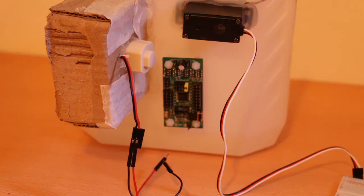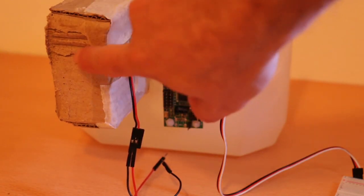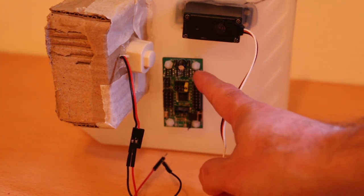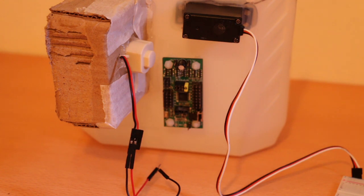This is the backside of it. When I build DIY stuff I prefer using whatever I've got lying around and not buying anything — I admit my drawers are a bit fuller than most people's. This is the backside of the servo, this is the DC motor in charge of the fan, and this is a board that has an H-bridge already on it. I used it so I can operate the DC motor without having to buy or build an H-bridge.